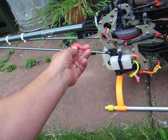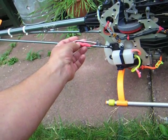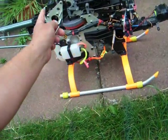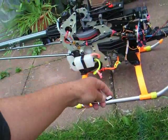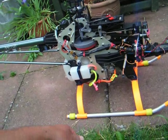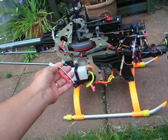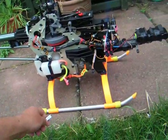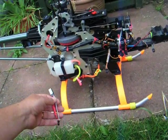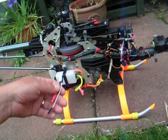That's why I haven't put this unit on — I personally think it's too small. A lot of people try running their whole helicopter on these things and they get really hot and can blow, and that's it, you've lost it all. That's why I've stuck to two big diodes, controlling only the gyro and the tail servo. All the other servos can take the six volts — they're analog — and because it's six volts they actually work faster and get a little more torque and speed. For those who want to know how it's done: you either buy one of these and put it in line, or get your own bigger diodes that handle more current and put them in line with your gyro or tail servo. Each diode steps the voltage down 0.6 to 0.7 volts — that's called a step-down — so your tail servo should never blow up.